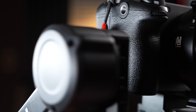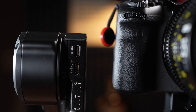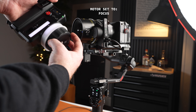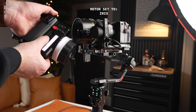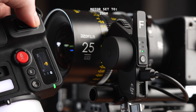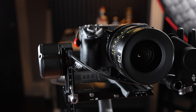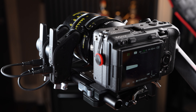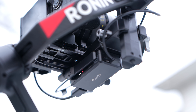The front of the gimbal has two USB ports on the front and one USB port on the back. The back port is for your camera control cable. For the front two USB-C ports, the top is for the focus motor and the bottom is for image transmission or LiDAR. You can also tell the focus motors what you're adjusting — whether focus, iris, or zoom. This is a nice update over the RS3 Pro, because previously if you wanted to adjust focus and zoom you had to use both front USB-C ports, leaving no room for LiDAR or image transmission. Now you can daisy chain all the focus, iris, and zoom motors together and still use the bottom slot for image transmission or LiDAR.